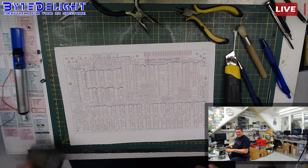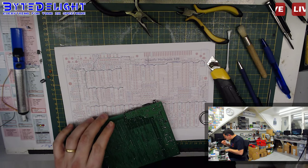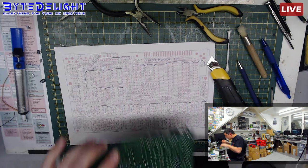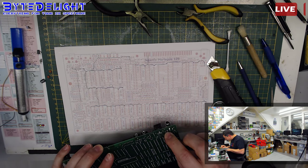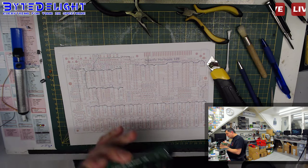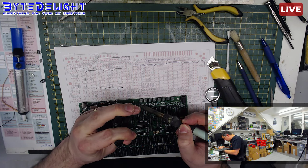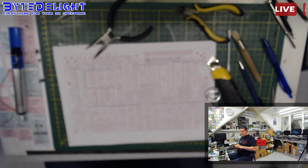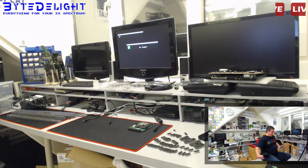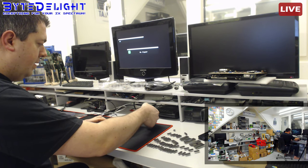Another failure. We're still looking. Yeah, we'll measure R8, by the way. That's a good one. It was really a solid block, but most probably it wasn't connected to ground. Well, we'll just lift R8 on one side, but that's the easiest thing to do, of course, here. So, that's done. We're going to do another test. Swap the camera.